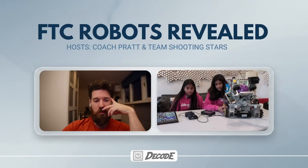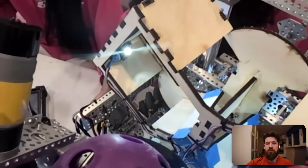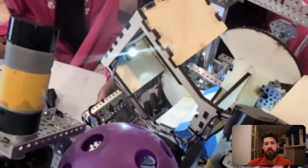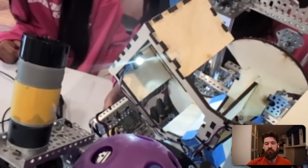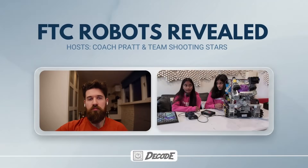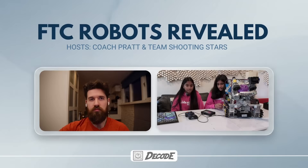I've also seen some lights on the inside of those corners — it looks like you have color sensors in the edges as well. How is that working? We have three color sensors, one in each corner of each chamber. They work really well — we use them as proximity sensors too, to make sure that depending on how close or far the ball is inside each chamber, the color sensor still identifies that there is a ball and identifies its color, even if the RGB values shift due to distance.